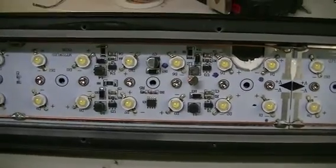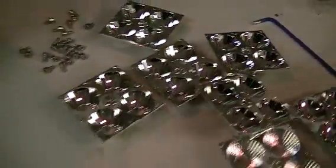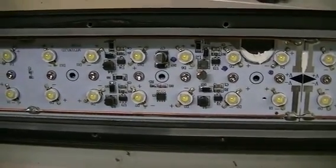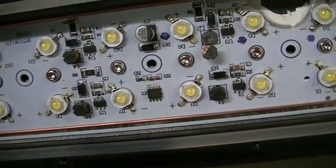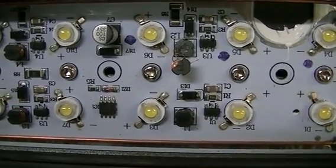Quality control out of China is not so good because it never worked from day one. They obviously didn't test it when they put it together, because once it's together there is no way that inductor could get broken — there is no external damage on any of the panels. There is a big sheet of plexiglass that goes across the front as well. So that was obviously never working from the day they shipped it. Now we're going to desolder the rails, take the screws out, pull that whole module out, get what's left of that inductor out, and may even find one that's close enough in an old TV circuit board and replace it.